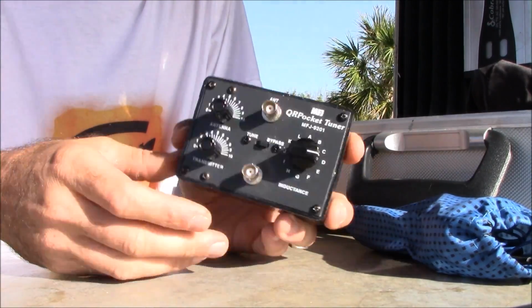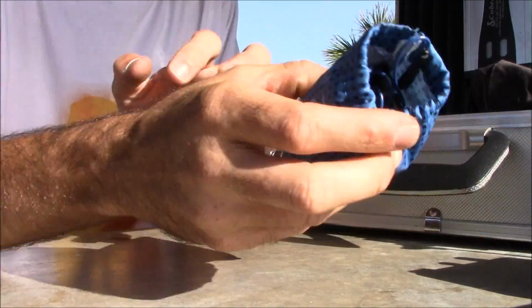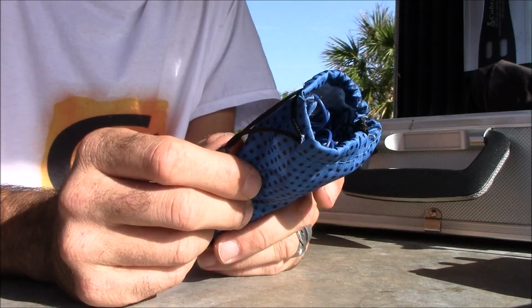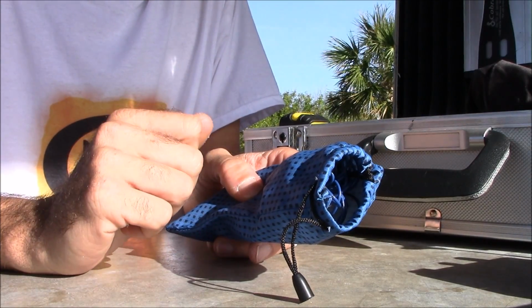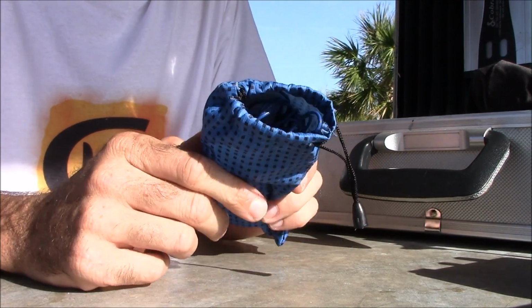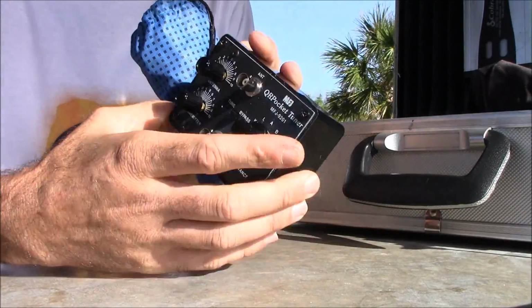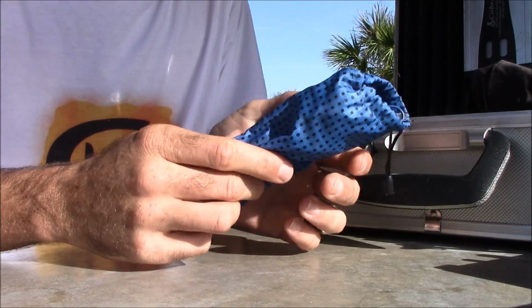So I can use this to have a wire. The antenna that I have in here is cut for 20, but if I use the off-center fed from the November 9 Sierra Alpha Bravo video that I have, you will need a tuner. So that's where this comes in. I can use this with the 40 through 10 meter off-center fed, have a tuner.